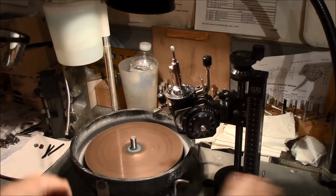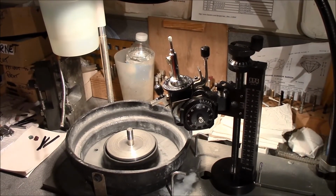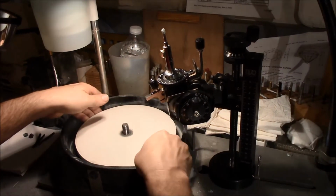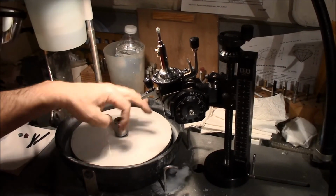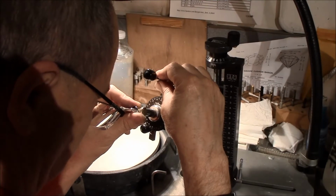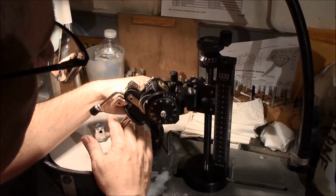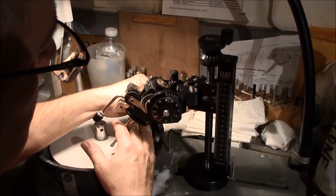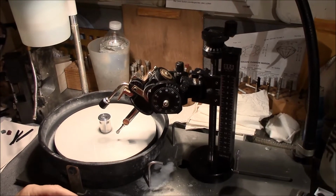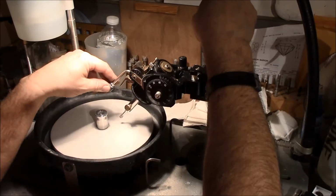Excuse me. I'll sling the water off. I'll pick up my RPM, sling the water off. Then I'll come back and I'll get my ceramic lap. It's already been charged. It's already had a little dose of silicone on it. So then I will go back to my original 40 degrees that I started off doing my mains. I'll tighten it in at 40 degrees. Now I'll put it on about 7. Don't use any water on polishing this.